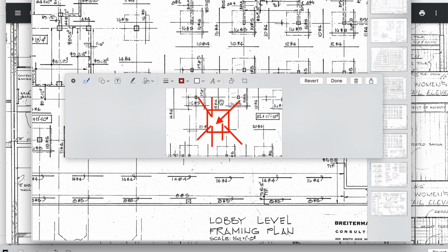So let's remove those. It doesn't appear to be 6. It appears we get a dab at 4. What makes this important is that this would then allow this steel out here to help transfer, if steel was there. If steel was there, it would help it get back into the heads a little bit. And then we would have one piece of steel across the middle. And then we would have one piece of steel here. And at least we would have starting to get a stronger critical shear area.